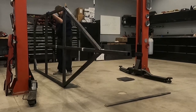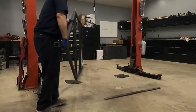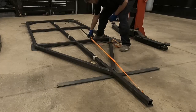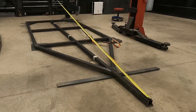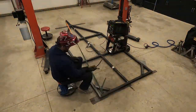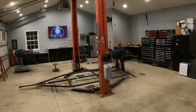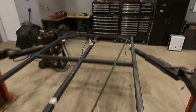After finishing the tacks on one side, I wanted to flip it over so I could tack the other side before doing any finishing welds. It's a little heavy and awkward, but I was able to flip it over by myself. It was either the heat from the welds or me flipping it over that caused the frame to be slightly out of square. However, I was able to fix this by using a ratchet strap and then re-measuring to make sure it was back in square. I went around the trailer and put tacks in every spot that didn't have one. Now that it's all tacked together, I wanted to get it off the ground to save my back a little while doing all the finish welding. Here's a good view of the trailer frame ready to be finish welded.